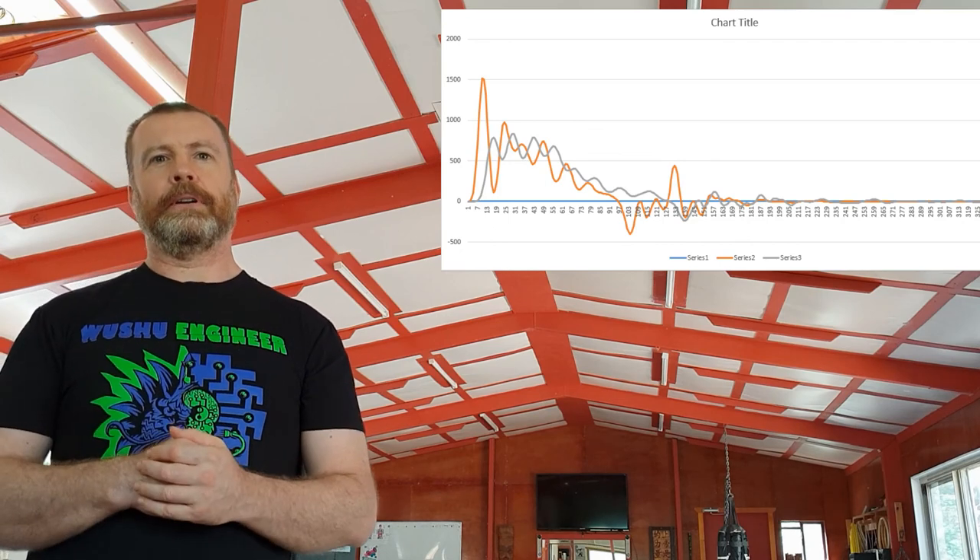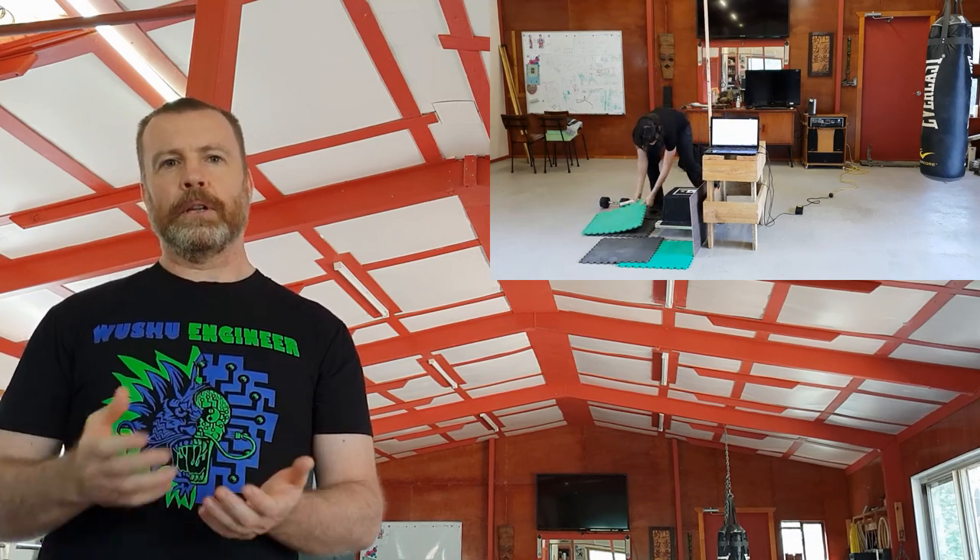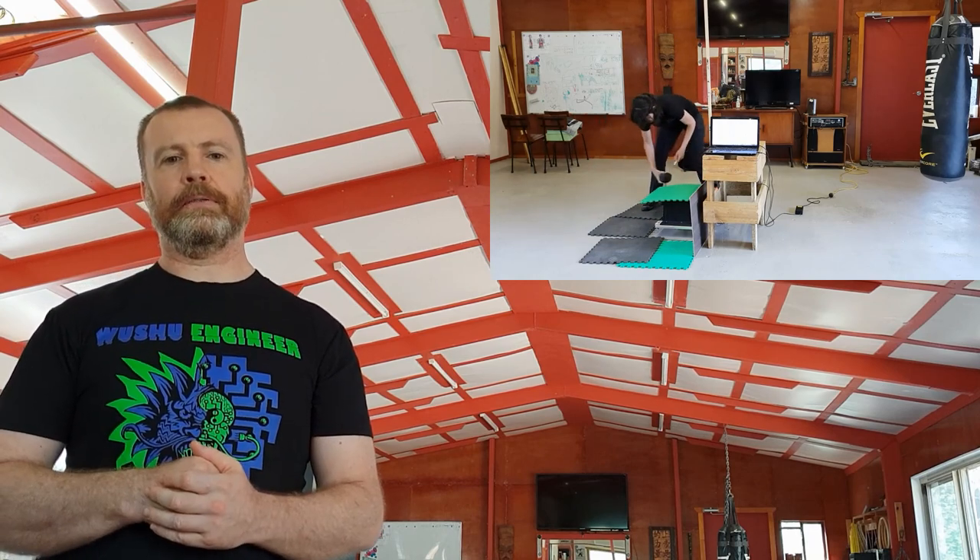This leads to plots that look very messy and complicated. As you can tell, directly assessing peak force from this waveform is essentially impossible. However, what we can do is assess impulse instead, which is the integral of force with respect to unit time and represents the change in momentum. Because the data is sampled at discrete times, we can perform a numerical integration — simply adding the force values up and multiplying this total by the time step, which for a 1 kHz sampling frequency is one millisecond. Impulse, being a change in momentum, is equal to the mass of the impacting object multiplied by its change in velocity. Once we have the impulse, we can thus potentially calculate the mass or change in velocity of the impacting object, as long as we have one or the other of these two variables.